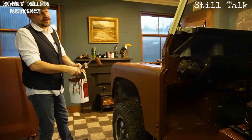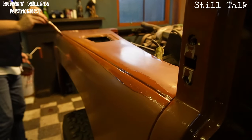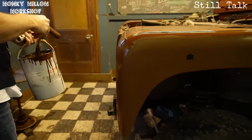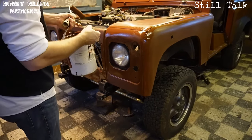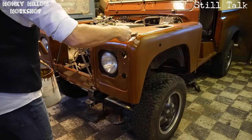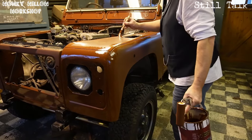On the vertical, what we are looking for is the seams, the joins, the bits that the roller does not get into. You basically take the brush and put the paint in the seams — the bits the roller is just never going to get into. That's where you start, putting paint in all the seams. If you take a panel at a time you don't have to worry about your dry edge. A dry edge on a summer's day could come along in 5 to 10 minutes on a warm day. A colder day gives you that wee bit of extra time. If you start working it too much on a warm day, your roller ends up disintegrating and sticking to your panel.